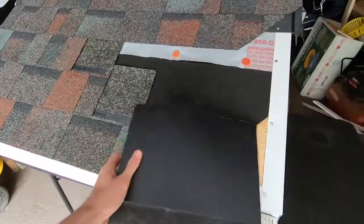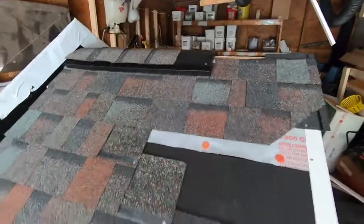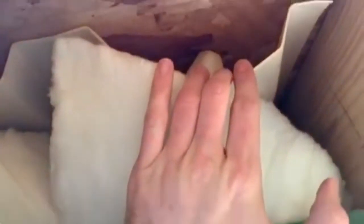On the other side of this vented soffit, you've got the insulation in your attic and then you have a baffle. This baffle is very important because it allows the air coming through the soffit to still get in there and go all the way up into your attic space. If you don't have the baffle, all the air is just going to get trapped right in that spot.